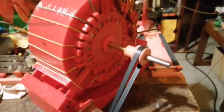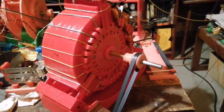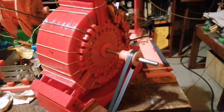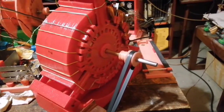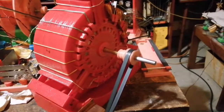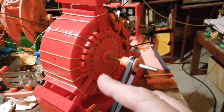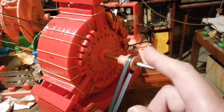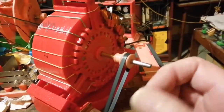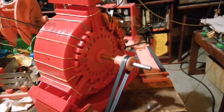Right, so it runs the switch or not. But when we get down to a speed of about 400 RPM, when it's dropping, I get a lot of magnetic resonance effects, which is to be expected, because at certain frequencies the segments, the nanocrystalline material that's in the slots starts to resonate, and it makes a bit of noise, kind of like a hum.